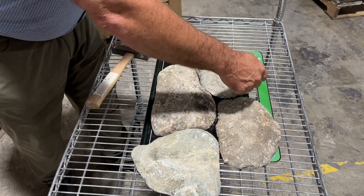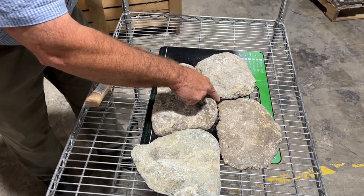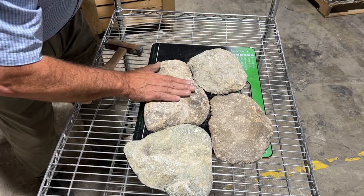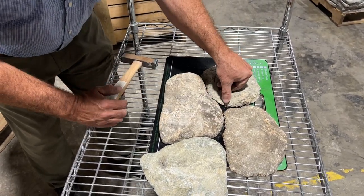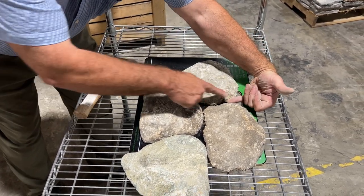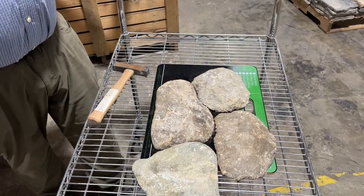Later I'm just going to grab my grout bag and fill these joints in. After an hour or so I'm going to compress it and dig out some mortar — it'll be way down here in the face. The pointing mortar will be back probably three-quarters of an inch from this face and almost flush down here at this low point. Over here it'll be just down here, so the top of my pinky will be the top of the mortar joint. Then you give it a little brush finish and you're done.